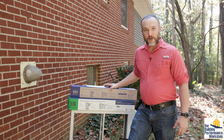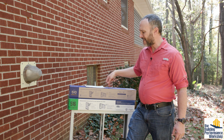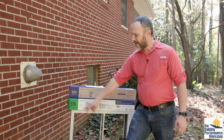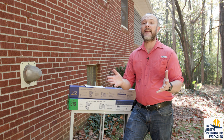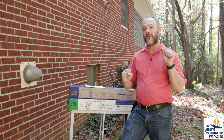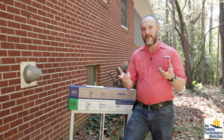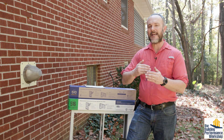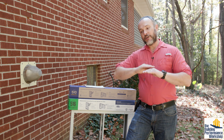What my father has chosen — because they don't have asthma, allergies, or pets — is the same size filter in MERV 11 instead. MERV 11 is the minimum for human health; that's the beginning of where you want to go. MERV 11 grabs 65% of big particles and 0% of small particles. Small particles are what are created when you cook, when you're cleaning, or when you're warming surfaces — which heating and cooling does too. That's actually a side effect of this heat pump: it's not going to warm things quite as extremely as the furnace did; it'll be a milder temperature more of the time.